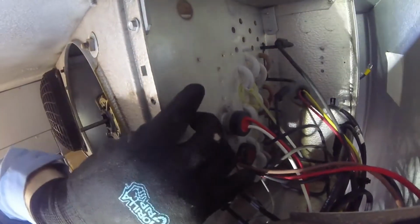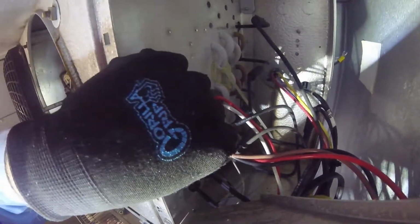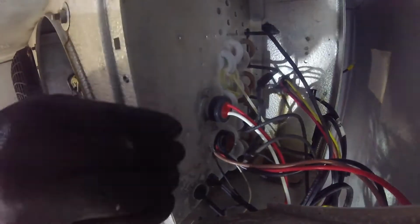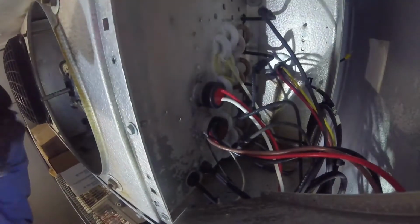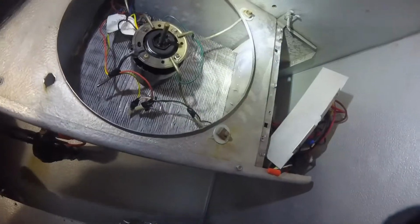The red is the hot, the common going in, it's the neutral wire you wire up in there. The black goes to your fans, so when the evaporator gets cold, on this particular switch, it's set for 35 and 55. So at 35 degrees, it's gonna close red to black, turn your fans on. And then if it gets too hot, above 55 degrees, it's gonna close red to brown, send power up to your X terminal on the timer and kick it out of defrost.